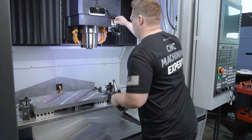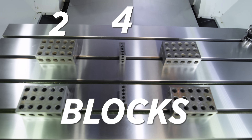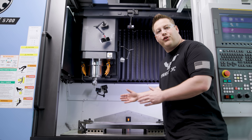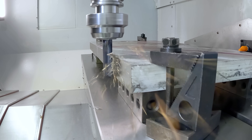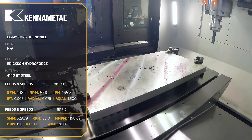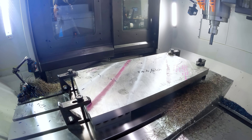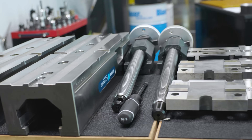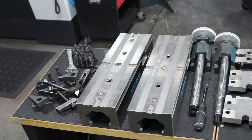This material was cut out of plate stock, so all four sides had sawed edges. We toe clamped it on some 246 blocks and milled down the length of the part to establish the 15-inch width. Then we came in and cut two witness marks on the length so that when we set this thing up in vises, we can probe that milled edge and find the center of our stock.